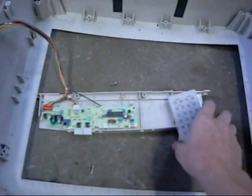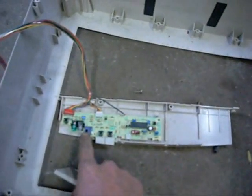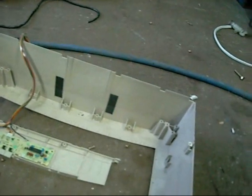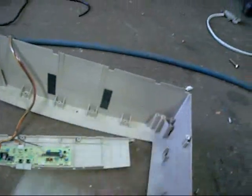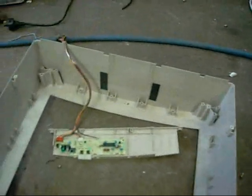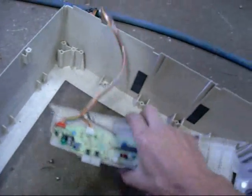That's the front cover or front control panel. This one has an infrared remote to control all the functions, with a little pick-up sensor. The front panel buttons are very minimal but it's got this little remote which slots in. I had a full system for this — the whole Indigo Silicon Graphics system with IRIX on it — and I sold that to MattyVT93. I'll hang onto some bits just in case he wants them, as the one I gave him displays a very purple image until it warms up, which is probably a dry solder joint on the colour drive board.